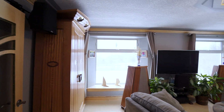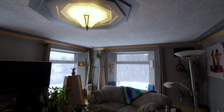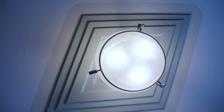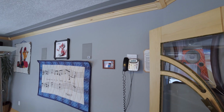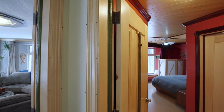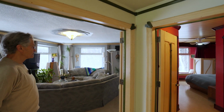This is the listening room. All the ceiling moldings in the dining room, the living room, and the vestibule I've made, and that's just 1/2-inch gyprock. Yeah, and you were saying the wall separation you did, it's like... It's 2 layers of 1/2-inch drywall, and it's separated on all the interior walls by 1/2-inch sound channel. And the reason for that is to help isolate sound transmission from one room to another. So it ends up being a very quiet house.